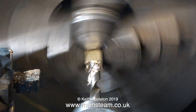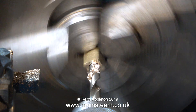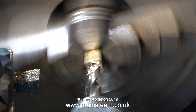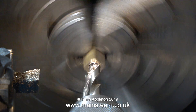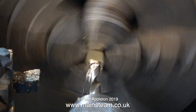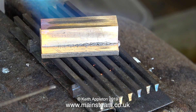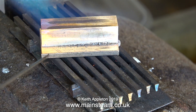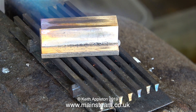In this clip I'm drilling a hole 5/16ths of an inch in diameter down the centre of a square piece of brass bar. Please be aware that brass is not a suitable material for this bearing — brass just wears out very quickly. At the moment it looks like I'm going to be using brass for the bearing; I'm silver soldering the piece of brass to a smaller piece of brass plate.